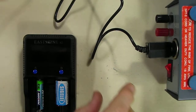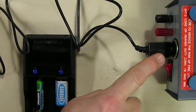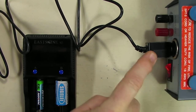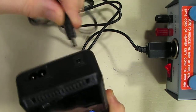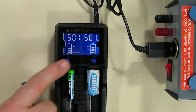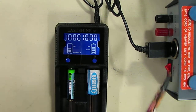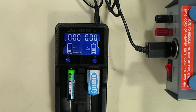I'm going to do a little test with the 12-volt cigarette lighter adapter that it comes with. I plugged it into a 3-amp 13.8-volt DC power supply that's simulating what's in your car on your cigarette lighter. Using the included cable with those two batteries, I'm plugging it into the mating plug — and there we go, you can see it working right now. You have selection of 500 milliamps or 1 amp, so it works if you wanted to use this in your car or with an external supply.